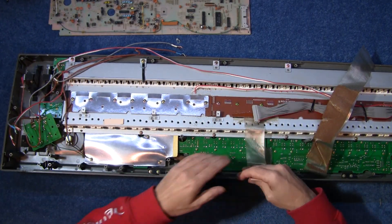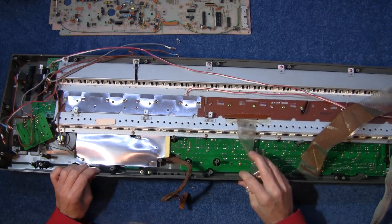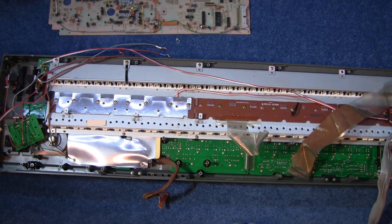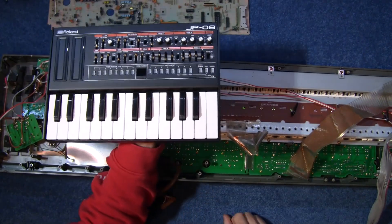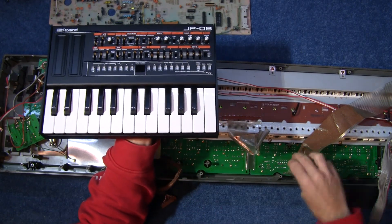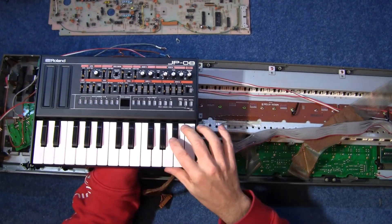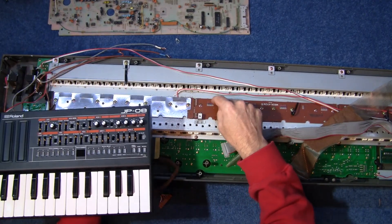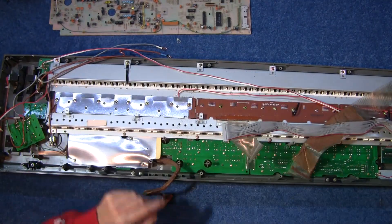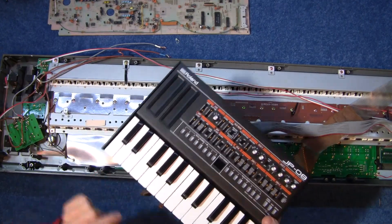Now the keyboard is always handy to keep. This is a matrix type keyboard because it has rows of small diodes on it, and that works very much in the same manner as the keyboard on these little boutiques. These are little 25 key keyboards and there's a connector similar to that which connects the keyboard to the unit. It's not a MIDI keyboard - it's literally just a little matrix keyboard that has all the diodes in it to make a matrix. Can I get this to talk to this? Well, no, because this will only accept 25 keys.